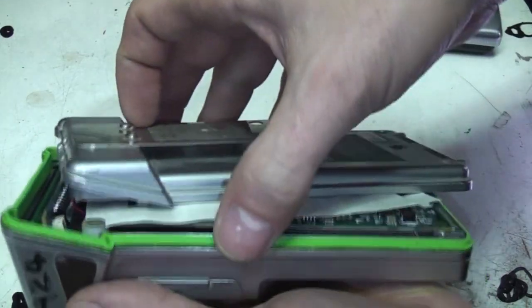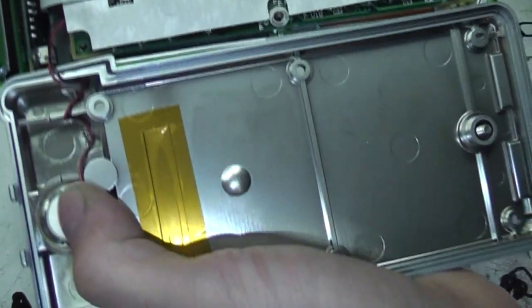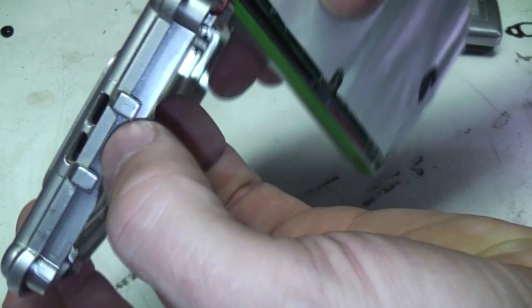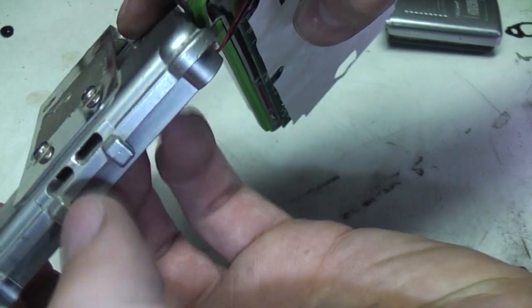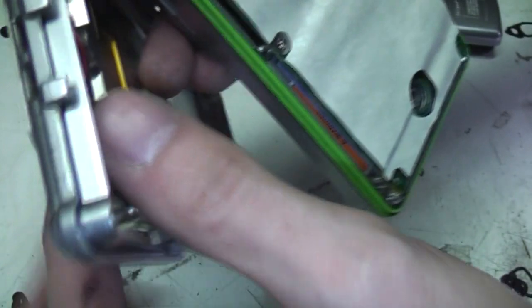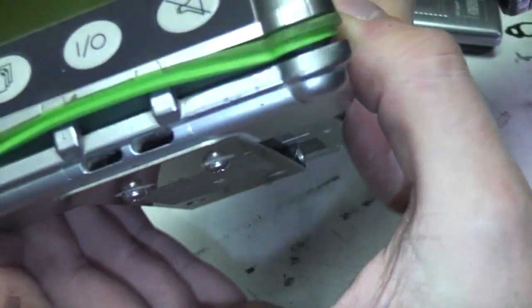You can see the green seal here. There's the beeper in the lid — that's actually mounted in a sound cavity. That's a fairly acoustically designed cavity which makes a massive difference to the level of sound you get out. And obviously this is designed to fire straight upwards as well, because on a belt-worn thing you're going to want to concentrate the sound outwards. For such a little sounder this thing is very, very loud.